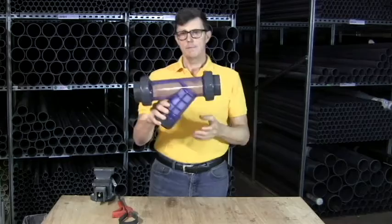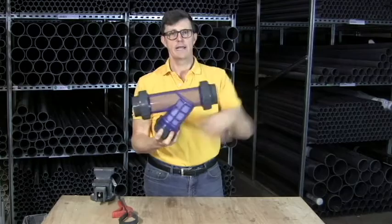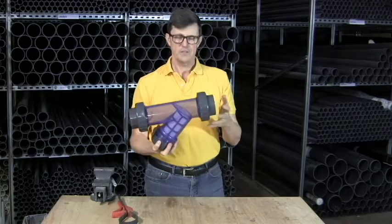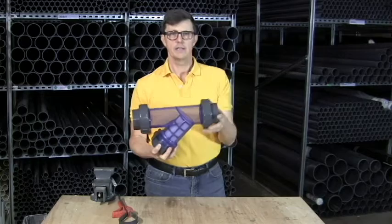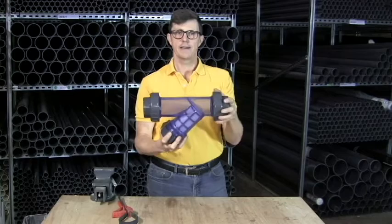People often put wire strainers either on a duty standby with valves either side — so a T with a valve and then two strainers — so they can have one in service and when that's being cleaned they take it out of service and start the water flowing through the other one. Or if it's not 100% critical, they may just have a bypass with an isolating valve so that in the few seconds it takes to clean it, they just bypass the wire strainer, shut it off, clean it, put it back in, and then put it back into service again.